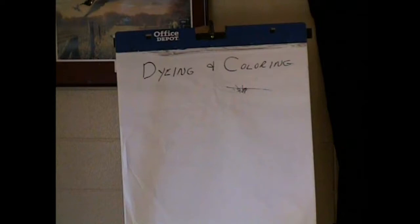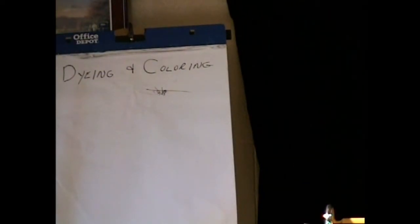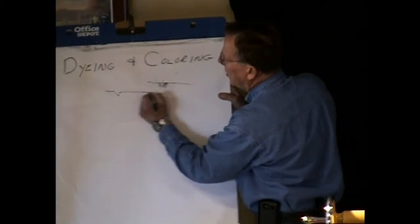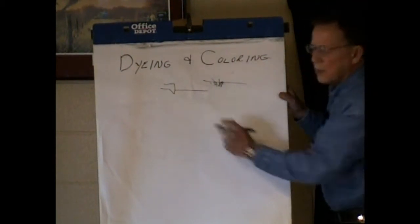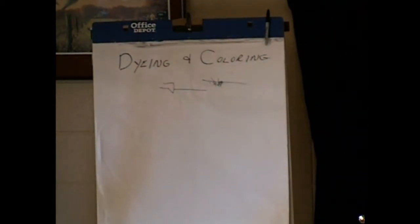And the important thing about these chucks is that this face right here, or the end of this, has to fit, or go up tight against, the outside edge of this chuck. You don't ever want this bottom to bottom out in those jaws. So what you do is you create that little place like that, and now your chuck jaws go in like that, and you get a nice solid mount for the chuck. And that's what we're going to do right now.